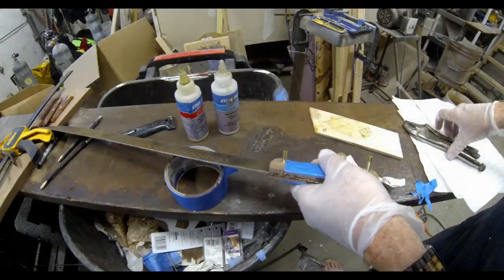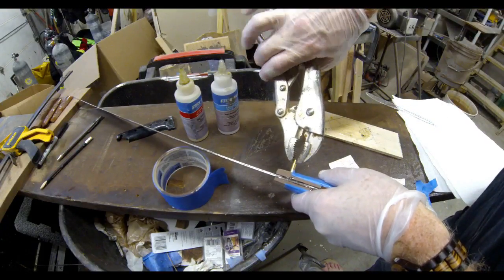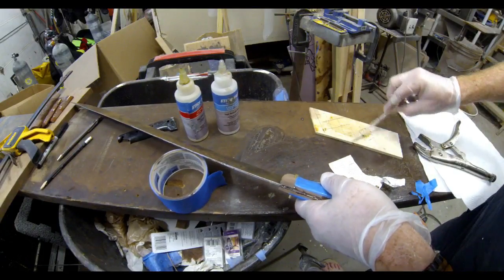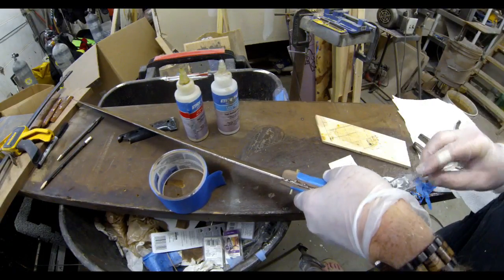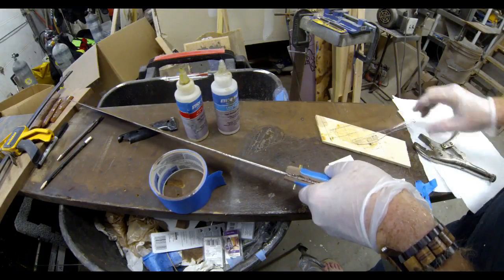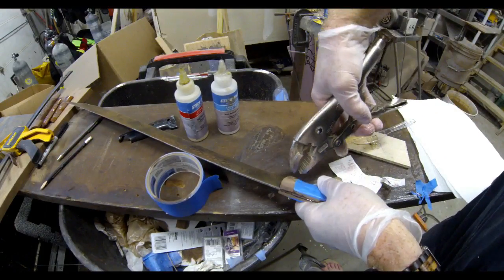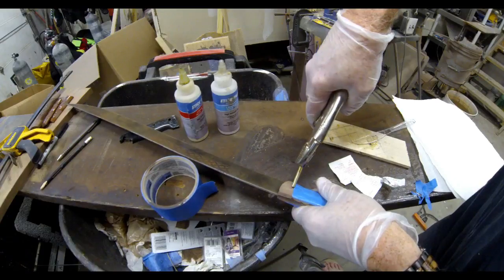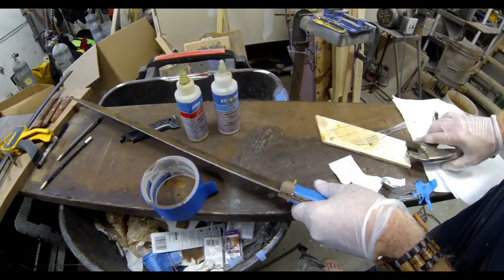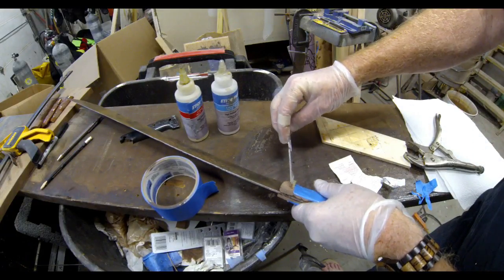Now I'm going to go back to the handles. I put some painter's tape over the basket weave pattern areas, and I'm just using a two-part epoxy and three-sixteenths brass pins. I'm going to assemble both handles onto the blade — everything is glued, and I use a vise grip in order to push the pins through. Then I'll clamp this entire assembly in a vise with a couple of additional clamps and let it sit overnight.